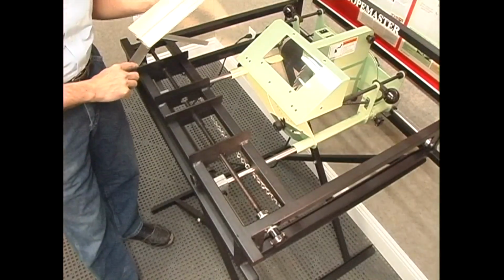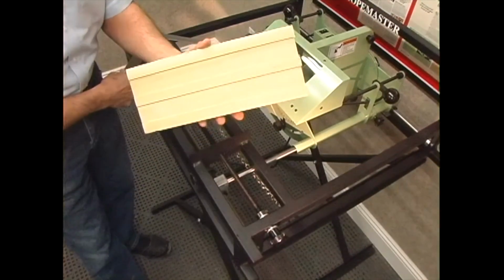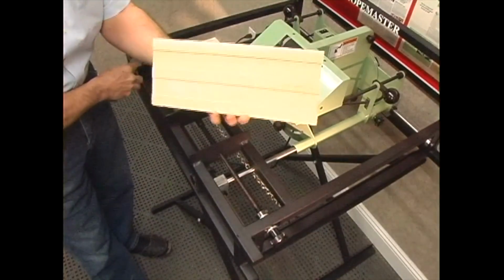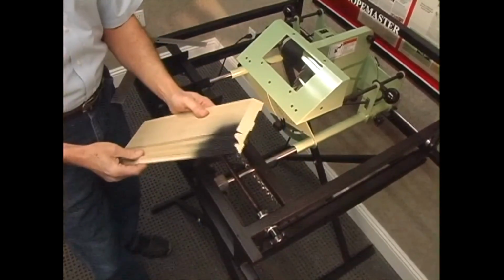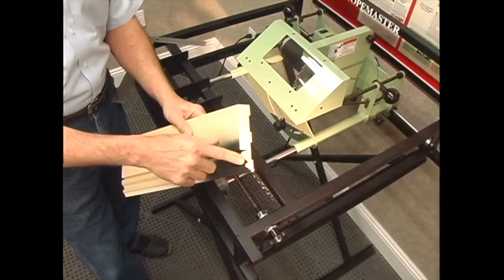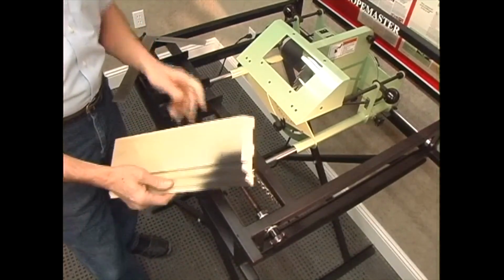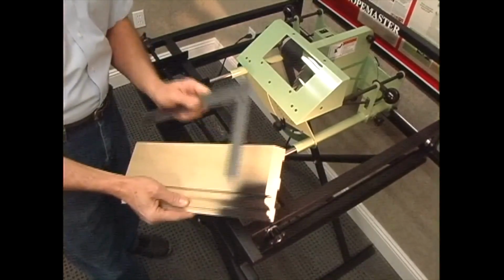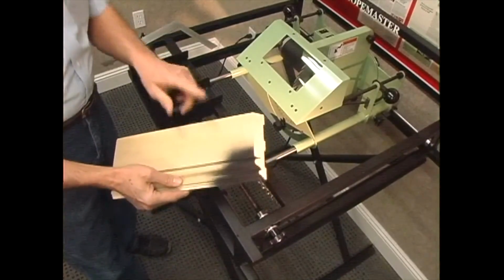Now that the angle is set, we can create our template. You need to select a nice flat 12-inch long piece of molding for the template. For flatness, check it with a straight edge across the back. To check for twist, place the molding on a flat surface and press on opposite corners. If the molding rocks, the piece is twisted. Spray paint the end of the board flat black and let it dry, and then cut your 45-degree bevel on the painted edge. This 45-degree cut is very important. If the saw cut is off, your cope will be off because this cut generates our high contrast cope line we use to make the template.